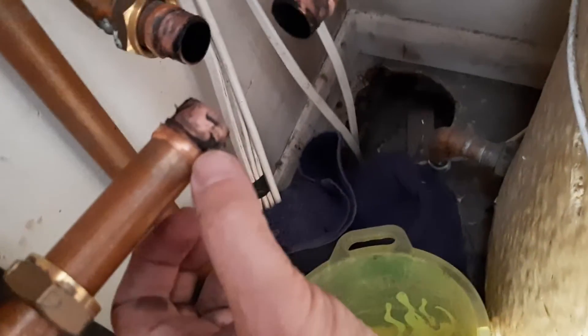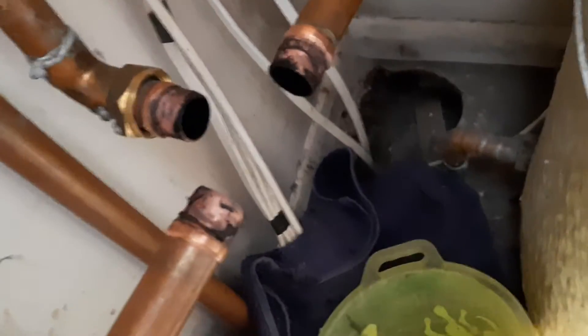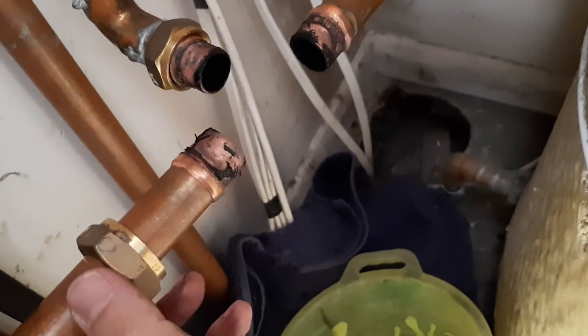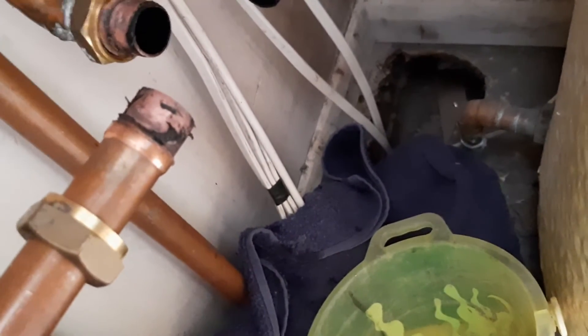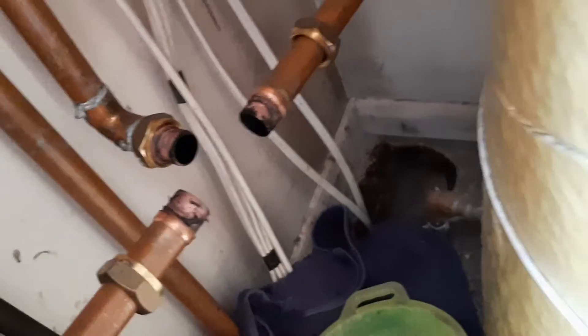What I was planning to do is replace these compression washers. You normally have to cut them off with a little saw, but they actually look like they're in pretty good condition. It's a bit of a gamble reusing them — lots of plumbers are probably shouting 'no, cut them off, put fresh ones on!' I do have fresh ones here. Cutting them off is a bit of a pain, but I've got a little hacksaw — actually, I will cut them off and do it properly, otherwise it could end up springing a leak.